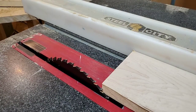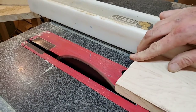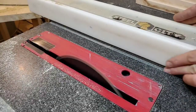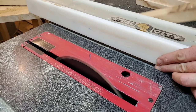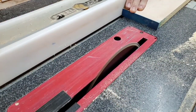Now I'm going to take roughly an eighth of an inch off just to make sure that the boards are nice and even on one side. This will be the lift that's going to sit together mating on the top. Next you'll have to slide your fence over — this is probably about an eighth of an inch. We don't want to waste too much wood; we want to be able to use this later for other projects to give us that depth.